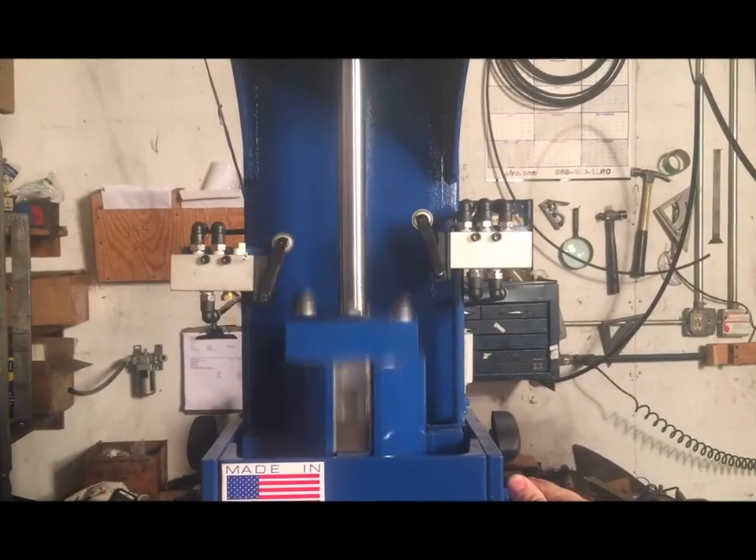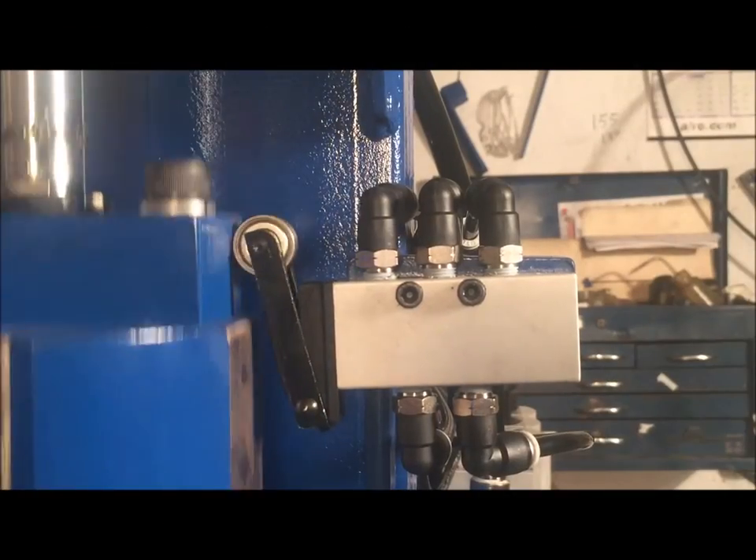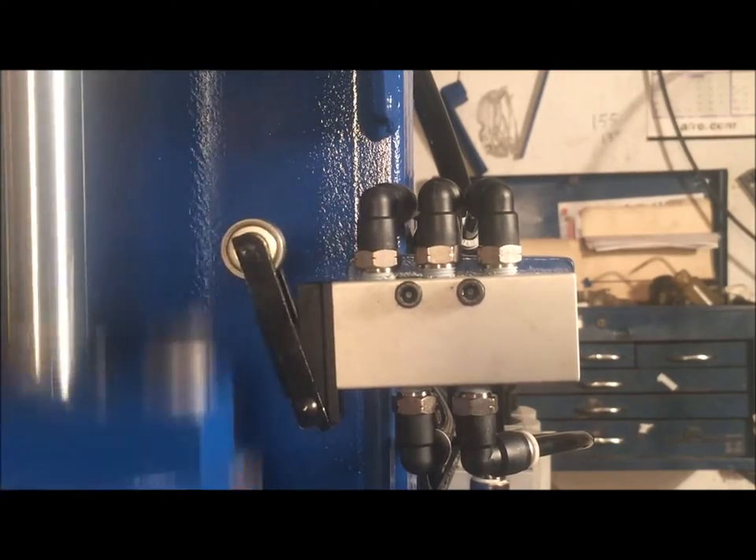On our hammers, these small valves work to set the top and bottom delta of the stroke of the hammerhead. The roller on the end of the arm gives a crisp change in the state of the valve as the hammer raises and lowers.